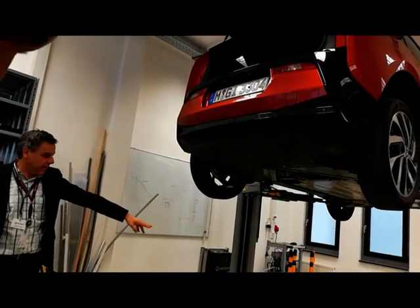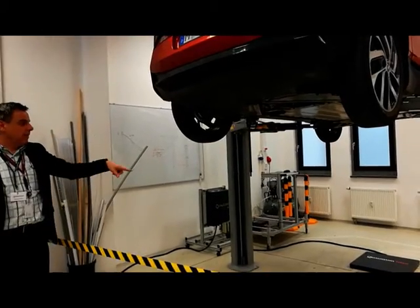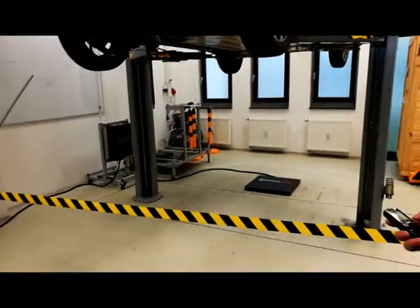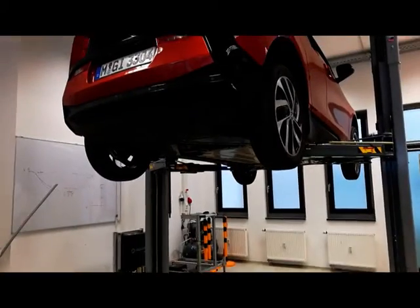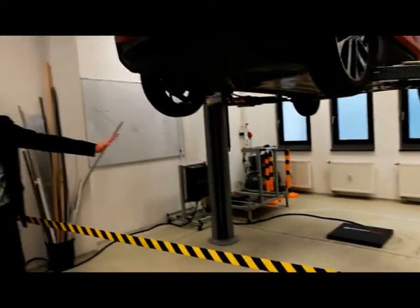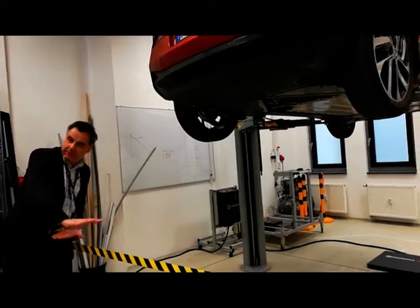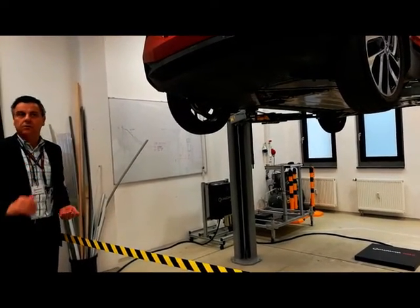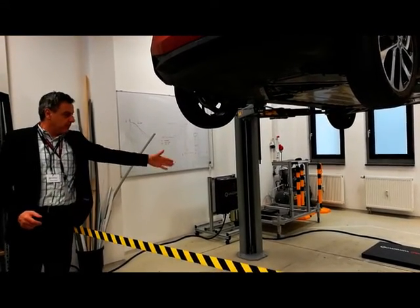A base pad laying on the floor is about 50mm thick. This base pad can also be hidden in the floor because it uses magnetic power transfer on resonance technology — an LC circuit with a capacitor and a coil inside. So this base pad can be hidden under the floor, or at least at the same level of the floor. In winter time when you need to clean the road, it should not be a bumper, it should not create a step like this.